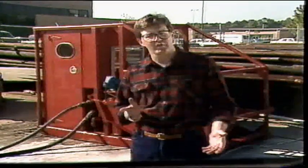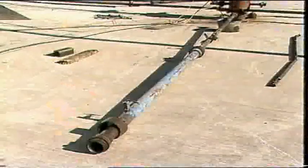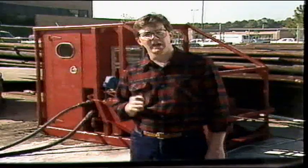Here at the Baker Training Center test well, we see the basic equipment required for wireline work. It's fairly simple and straightforward: a steel wireline, a system for reeling it into and out of the well, and the appropriate assembly of piping and connections to permit pressurized entry from the tubing. Also required are a device for accurately measuring the length of wireline in the well, another device to measure the force being pulled by the wireline, and a series of tools which can be easily and quickly attached to the end of the wireline. In this first unit, we shall follow the rig-up of a typical wireline system and become familiar with the basic equipment. In the following unit, we shall cover the subsurface completion components designed for wireline operation and the manner in which wireline may be used to solve subsurface producing problems.